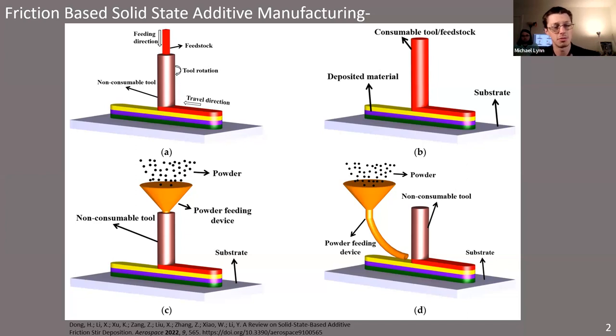Some of the ways this has typically been done in the literature: you can slide a rod through a rotating pin, and this pin stirs the end of the rod onto a surface to heat it up and deposit the material. The simplest application has been taking a rod of metal or plastic, chucking it in the collet of a CNC machine, spinning the rod, and rubbing it across surfaces to deposit the material as you drive around in tracks — which, of course, consumes the rod. There have also been many studies on using powders, because they're easier to consolidate and the energy barrier to getting them to flow is significantly lower due to their larger surface areas.